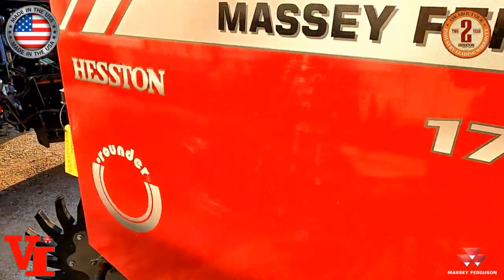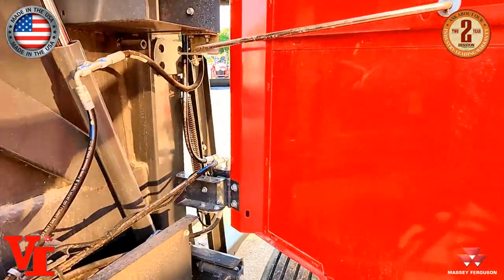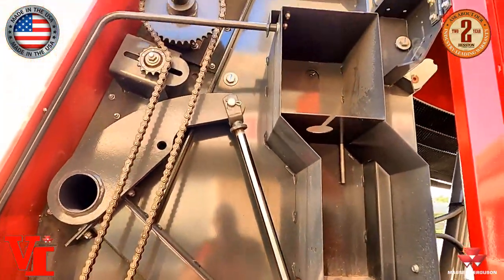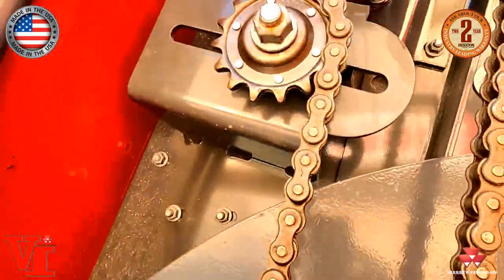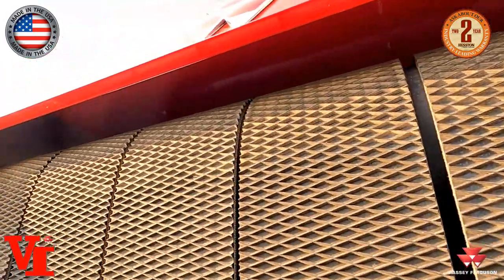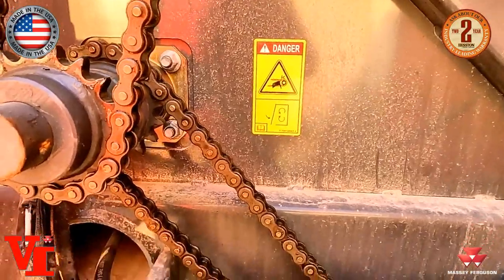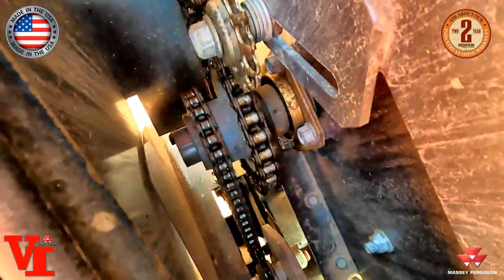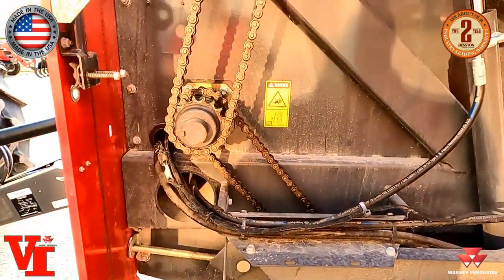We're going to slip in here behind this heavy metal door here on the left-hand side and look at one of the simplest balers in the industry. Just look at that side — you ain't got a whole lot of mechanization. You've actually got four number 60 chains on this baler: this one's going to run the rubber crown roller that is right up here at the top, which drives the belts on the front side. This chain is going to drive the starting roll down here, and if you look right down there, you're going to have two more that drive the pickup. So you have two #60 chains on the pickup, one on the starting roll, and one on the crown drive roller.